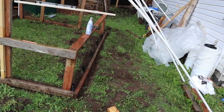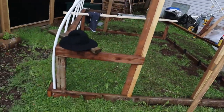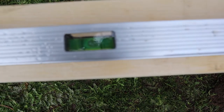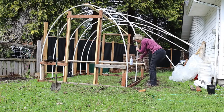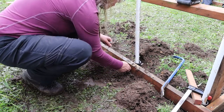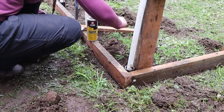I had to take out all of the attachments for the piping on this side because my daughter had dug out a trench to get it to sink in, but it only went down a little bit. This side should be okay now. Once we got things somewhat level, I checked from corner to corner — it's not perfect, but it's pretty darn close. I pounded in the posts, put in the hoops, and checked that all the holes were still in line. Then I put the carriage bolts back in, giving them a spray of silicone spray so the nut could thread back in despite all the dirt.